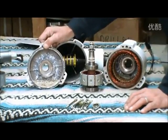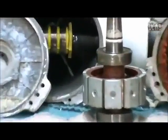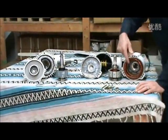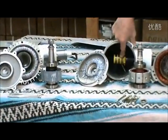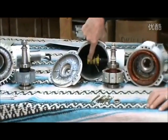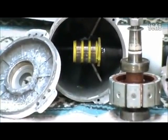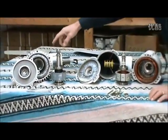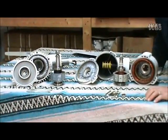People say they look the same — well, they don't. They do look the same when you actually look at them, but when you get inside, this is all you care about: the stator core and the guts. These slip rings are ready to burn out. My guess is they would last probably a year before they'd be gone. I'm not going to take apart the SkyMax — it's very difficult to get out of there — but it's one large block of copper, the SkyMax slip rings. It'll last virtually forever.